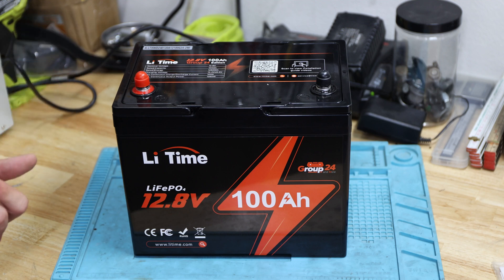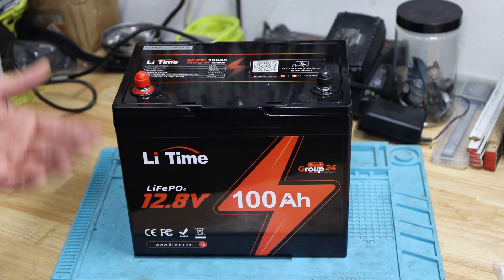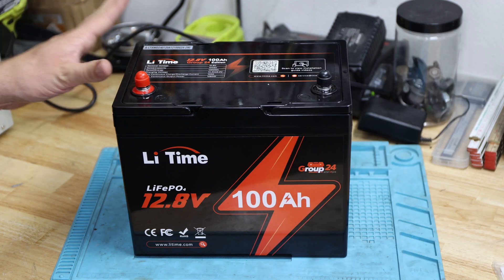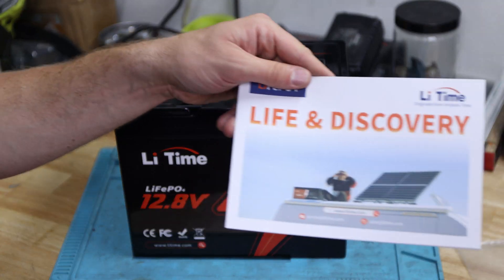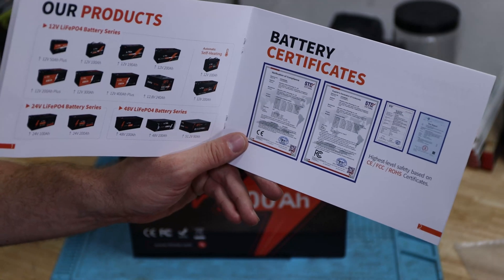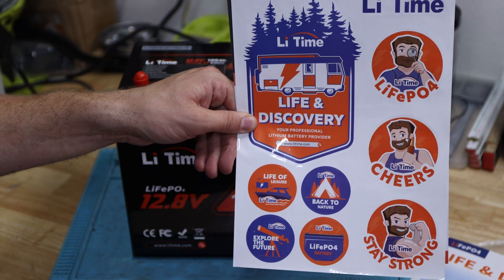Because of its size, this battery can in my opinion be used in campervans, and you can use a 4P4S or just 4P connection as needed. A 5P configuration might not be possible, depending on the BMS. It does come with nice packaging. Inside you'll find a page with battery certificates, which is amazing to see — showing highest-level safety based on CE and FCC certifications.